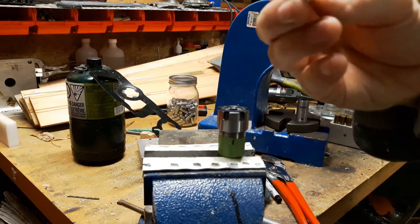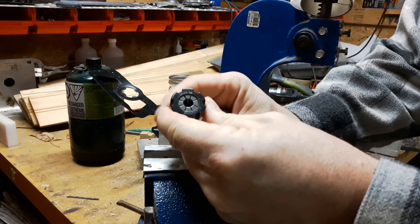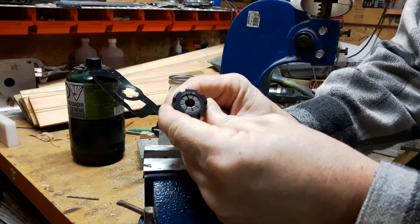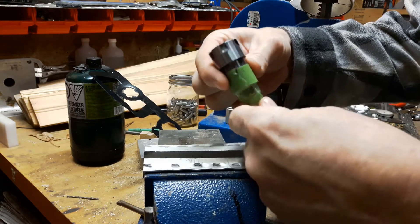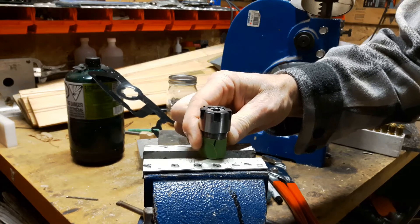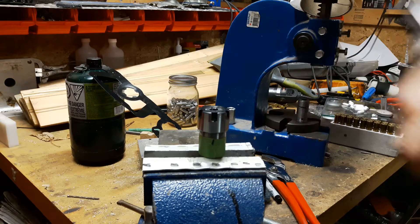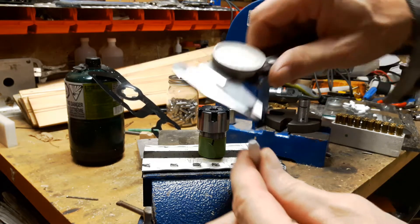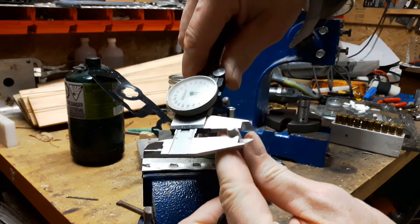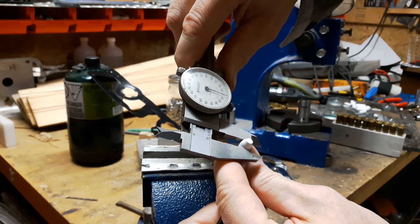Here's what I've done. You can see the collet here — I believe it's the ER20-M size. I'll post a link. There was a little bit of trial and error, and I put magic marker marks exactly where it tightens up and reduces the bullet to what I need. Right now we are at about 0.303.